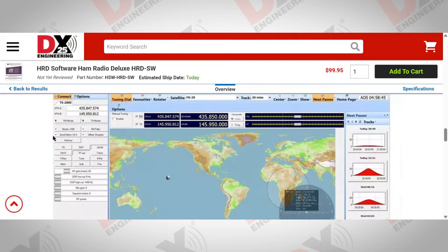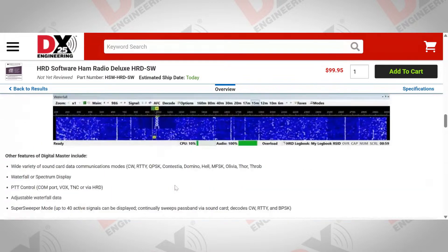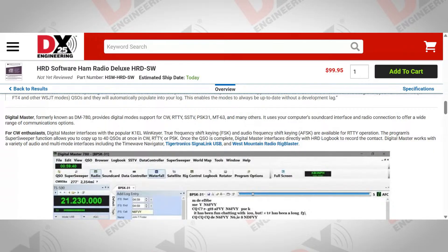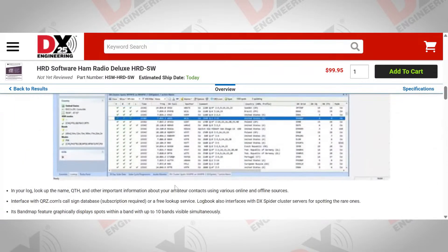The satellite tracking application will track pretty much every satellite known to ham radio as well as a number of others. It'll control your radio for Doppler shift and control your rotor for azimuth and elevation, so it makes the whole thing a lot easier than you might think. I've been a ham since 1974 and always thought doing satellites was too hard, but just a few years ago when I started working on this, it's just unbelievably easy and a lot of fun.